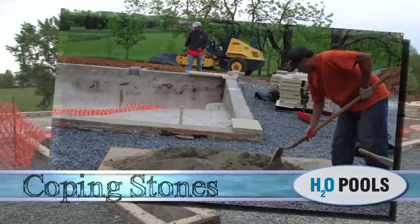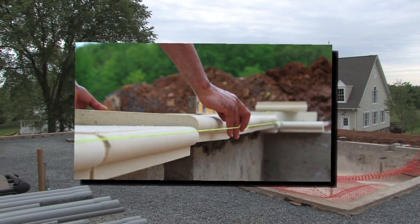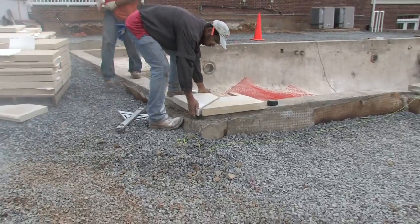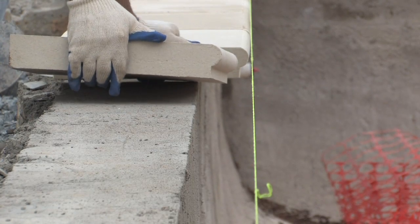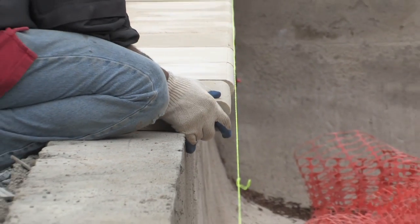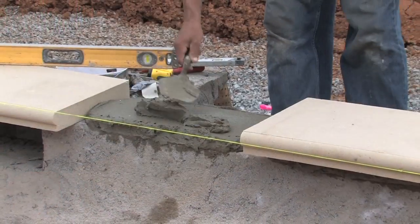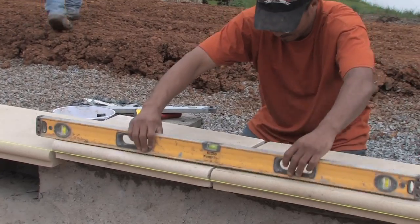With most of the heavy construction complete, it is now time to begin installing some of the more decorative elements. The first of these is the edge of coping stones that surround the pool. This stage is completely handcrafted — the stones are measured and cut by hand and then laid one by one using age-old techniques. There is no substitute for a straight line, a careful eye, and a steady hand. First the stones are laid without mortar. Once the layer is complete, the mortar is mixed by hand, taking into account the temperature, humidity, and specifics of this job. Finally, each stone is then placed in the mortar, leveled, and straightened until all the stones are set.